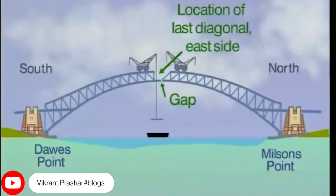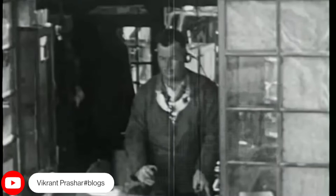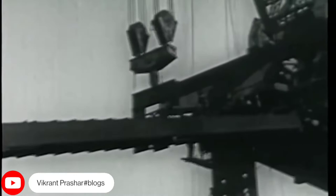This diagonal member forms the last triangulation at the crown of the arch. It was an essential stage prior to closing the arch. The arch members were brought from the workshops on a pontoon and lifted into position by the creeper crane. Diagonal being lowered to complete the triangle prior to the erection of the post and the corresponding top cord section.